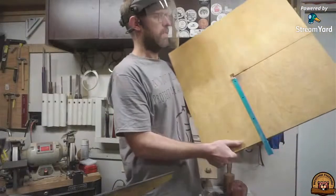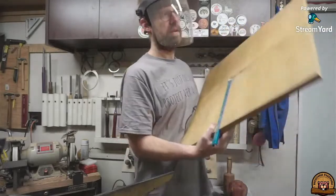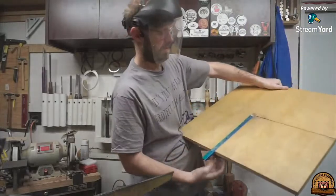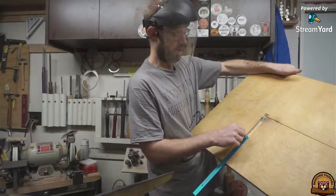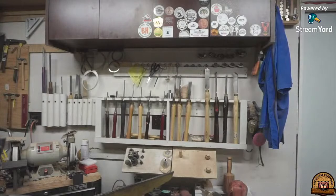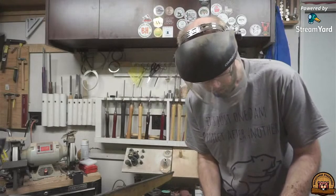Basically, it's just a piece of 3/4 inch plywood, a piece of metal T-track that's upside down, and then you have a knob with a bolt that goes through, and then the bit that fits on your bandsaw. And basically, you can just adjust this knob and slide this in and out to whatever diameter you want. You measure from the bandsaw blade to this little screw hole, and then you drill a screw hole in the wood, mount it on this screw, and then it just spins in a circle, and it works very good. It's in a lot of my premieres at the beginning, showing me cutting circles with it. But that can cut circles bigger than my lathe can handle, so that's how I would form the blank.